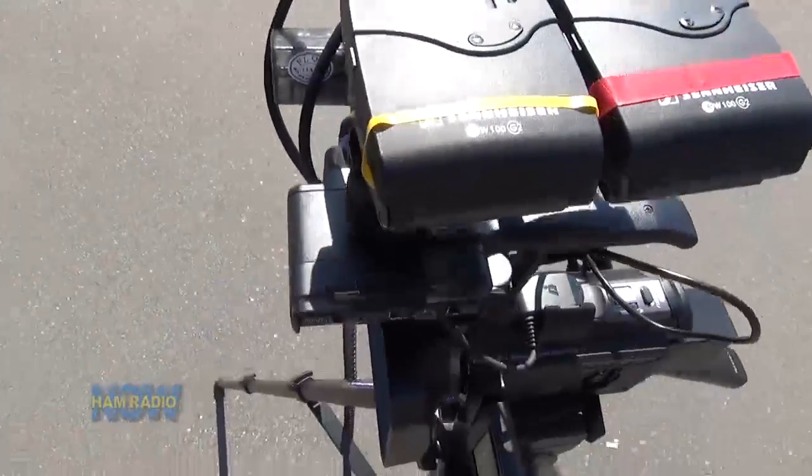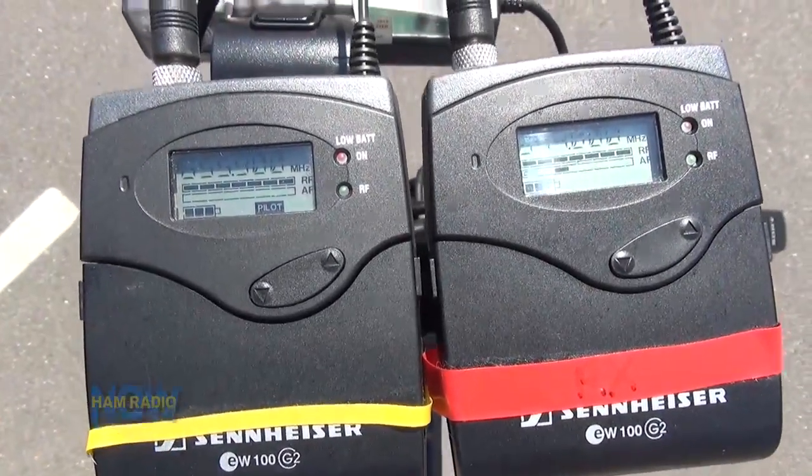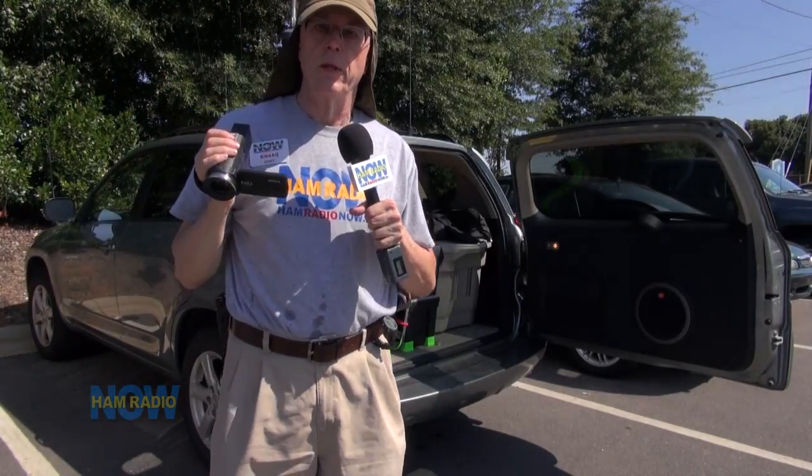It's a whole cool system. I'll show you my frequencies — I have to find new frequencies every place I go. These sit in the middle of the television band on so-called unoccupied channels. Back in the analog days of television, there was always an unoccupied channel because two adjacent channels couldn't exist in any one town. They had to be separated by at least one channel — usually two — because receivers weren't capable of separating adjacent signals. This system is frequency synthesized and agile; it goes from 626 to about 662 MHz — TV channels are 6 MHz wide — so you get an idea of how much space you can cover.